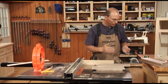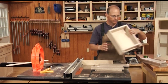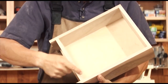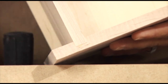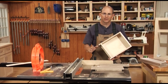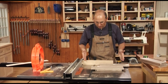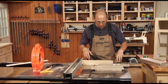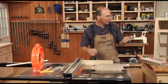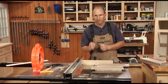The joint we're going to use at the back is simply going to be a dado joint. So the front is the lock rabbet and the back is the dado. These two parts will be the same length, and our drawer sides will be the same length, so I'm going to cut them both at the same time. I'm going to use the miter saw — I could use a miter gauge extension and a stop block, but I don't want to change this setup. I'll go to the miter saw, cut our boards to length, and we'll be ready to make our first cuts.